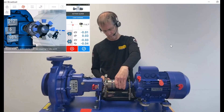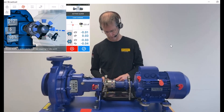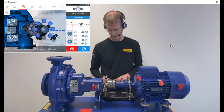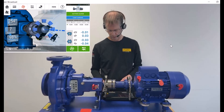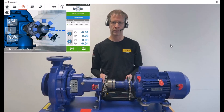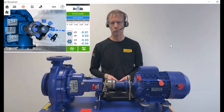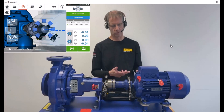At 3 o'clock, I need to turn a little bit further in order to be in the sector. The last reading is taken. I stop the sweep by pressing the white tick on the blue background. The results now show that both in vertical and horizontal, all readings of our alignment condition at the center of power transfer show in blue. We are now ready with the correction, both vertical and horizontal, for our motor.